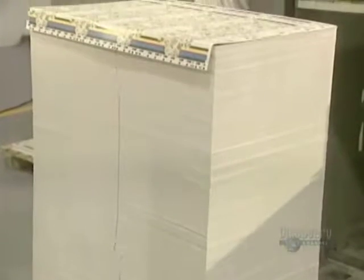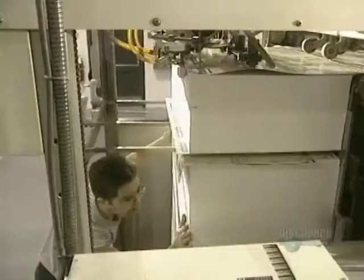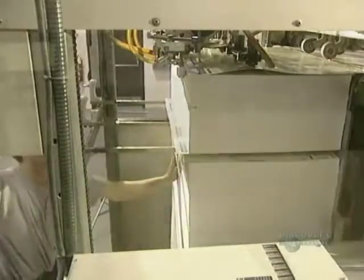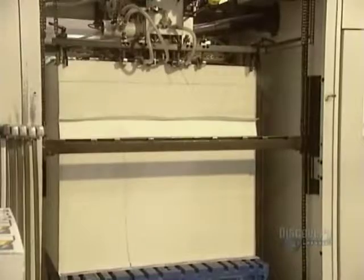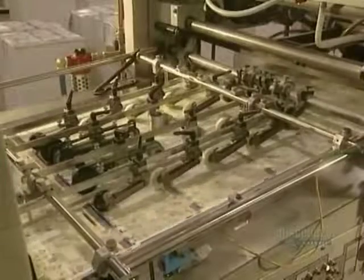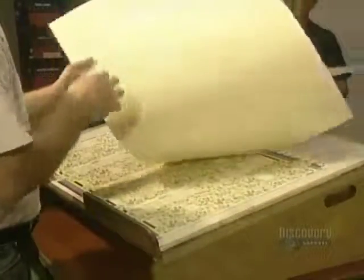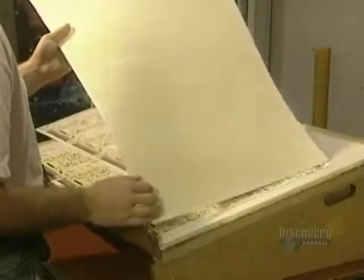A sheet is slid behind the cutting die to equalize the cutting of the sheets. This enormous pile of 3,000 sheets is ready to be cut. The embossing press feeder handles between 6,000 and 8,000 sheets an hour. Rollers guide the sheets in the direction of the press, where the sheets are embossed by the machine. The precision of the embossing is then verified.